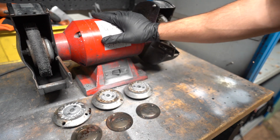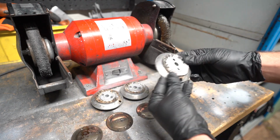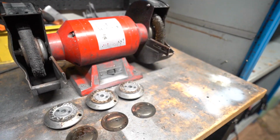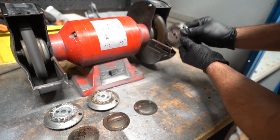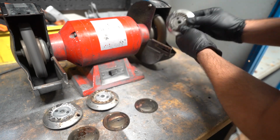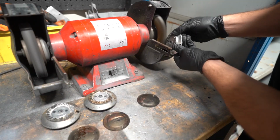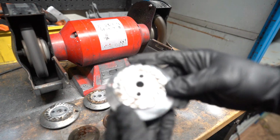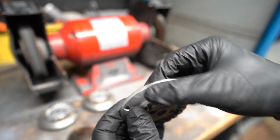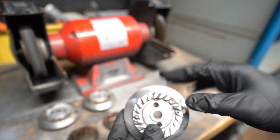Okay, so here we are at our buffing station where we get all of these cleaned. So first we're going to start with the harsher wire brush side, as these are quite bad. Sometimes if they just need a bit of a polish, then we'll move over just to the dry buffing area, but this will need a good thorough one, so we'll start with this. So as you can see, just after the first harsher polish, we've already got rid of all of that staining and grotty looking area. So now we can go ahead and polish this one over there and make it a mirror finish.